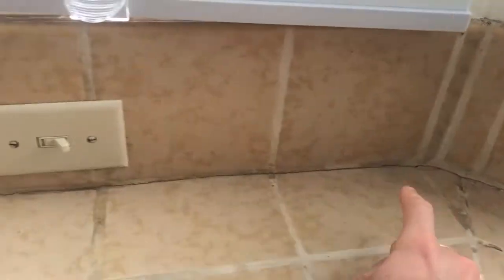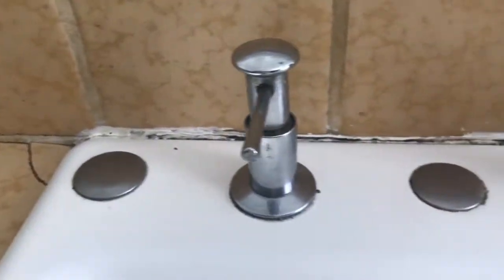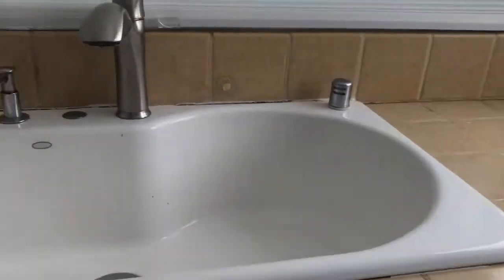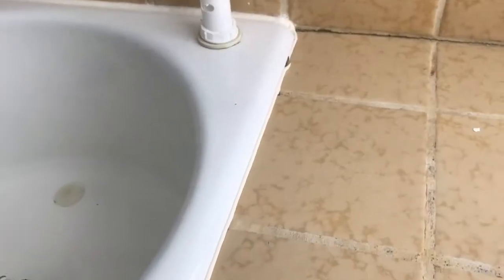This is what things look like after we've cleaned up a little bit. I wiped it with some soap and water, and then dried it, and then I hit it with some bleach Clorox wipes, and then I dried off the bleach so that I've got a dry and fairly clean surface to work with now. I also did my best to dry this out as much as I could before putting on the new stuff, so now we can finally move forward with applying the actual caulk.